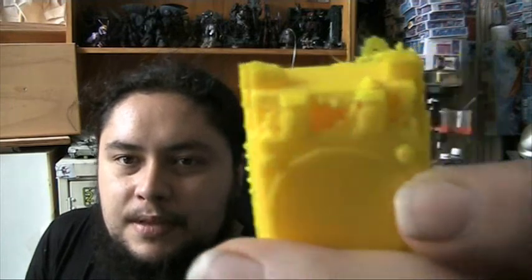Now, as that started getting removed, which was actually really thick and really baked on, the supports were printed thickly, close together, and as I started ripping them off, because the supports of this style of 3D printer are meant to be easy to rip off in ABS, it started ripping the actual detail of the model up, and started exposing detail right into the inside of the model.